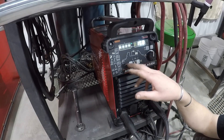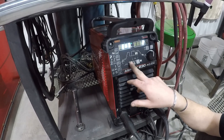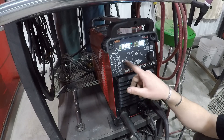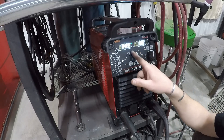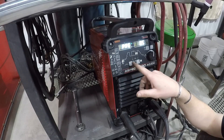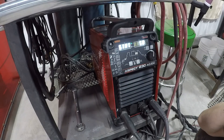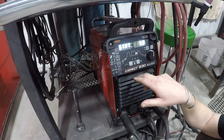Our other functions - the pulsing - that's still all the same. You go through your pre-flow, post-flow, your starting amperage, ending amperage, max amperage, and then your three pulse settings. I'm going to leave that off. I don't really ever use pulse on aluminum unless I'm welding out of position, going uphill or whatever it may be.